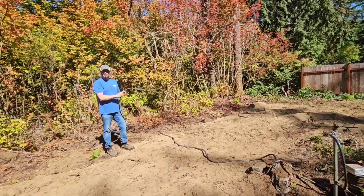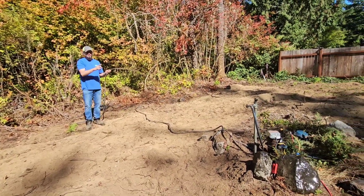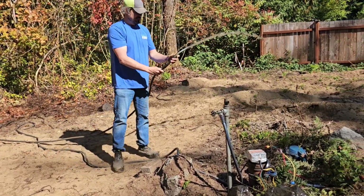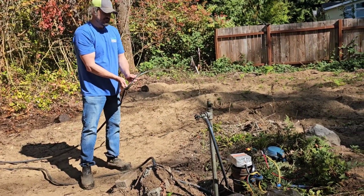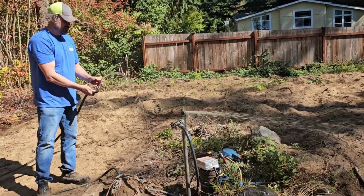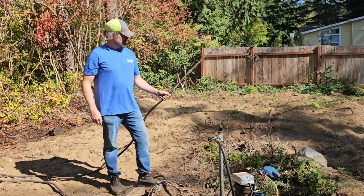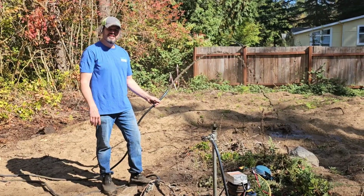That's a really strong pump, right? Look how much I have to restrict this for that 100. So the pressure is built up over 100 pounds per square inch for it to blow out that relief. So the relief's doing its job. That's a strong pump right there. I think we're just going to let this run for about 20-30 minutes, trying to clean it.